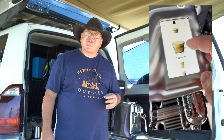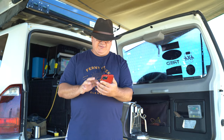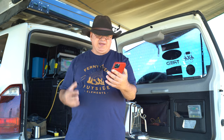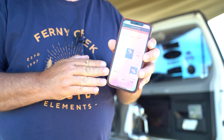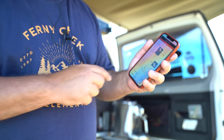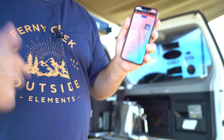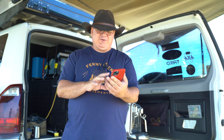I'm going to show you how quick it is to make a cappuccino. I'm using a Victron MultiPlus 2000VA rated at 1600 watts max — and that's only if the temperature is below 25 degrees Celsius. I can check the VRM portal app. My batteries are at 95.9% charge, and the internal temperature is 26 degrees, so we're right at that boundary of getting 1600 watts out of the inverter.